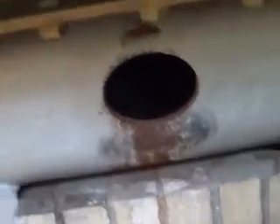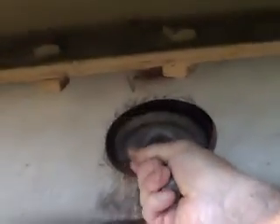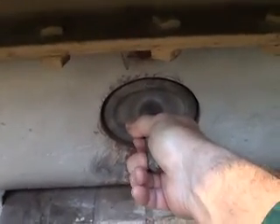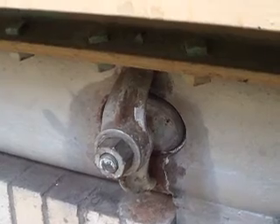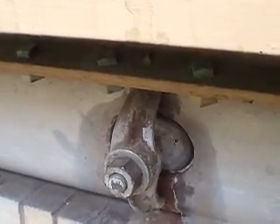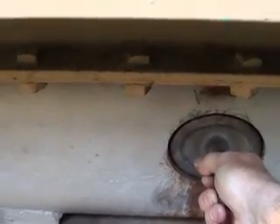Most of the time these are rolled in. This is an interesting design — it's egg-shaped for a reason, so it seals on the back side, not the front side. The more pressure that goes out, it pushes against the seal harder and makes it tighter instead of having the chance of blowing out. Here it is all put together: you tighten it down with that nut but you don't have to really torque it. You get it centered best you can, there's a crushed gasket that goes in there.